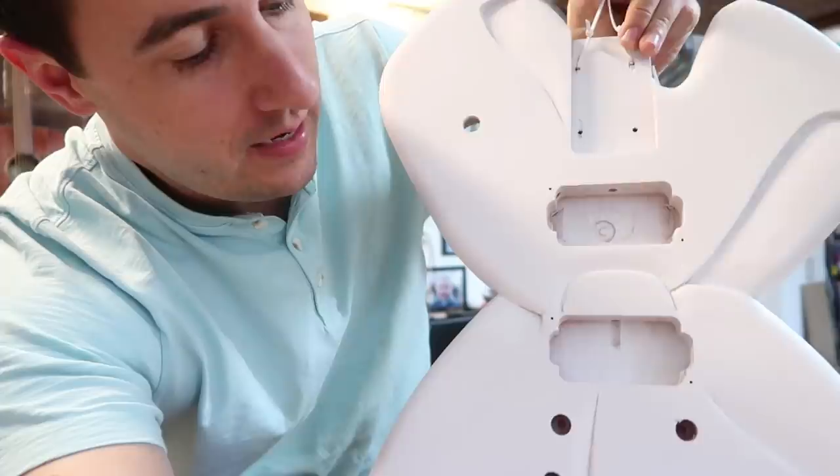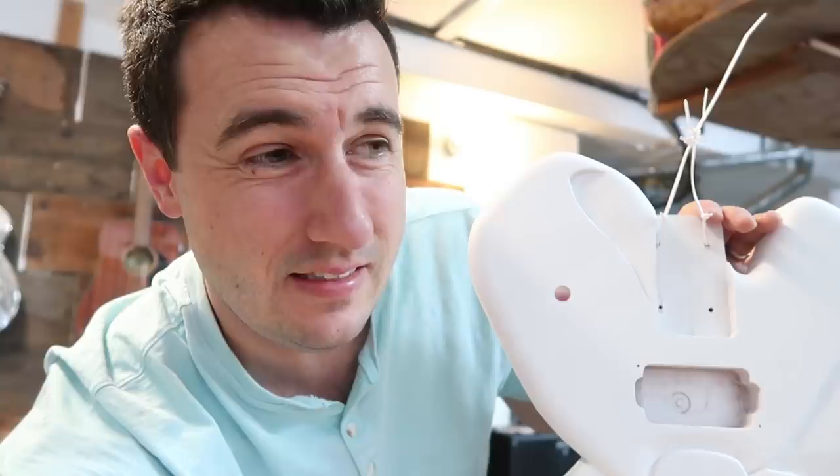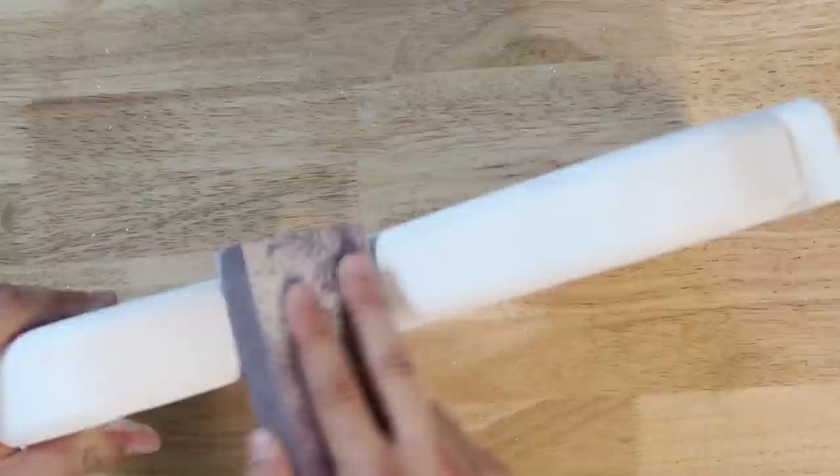So I finished that can of spray paint. I also hit it with a coat of gesso because that worked really well on Colleen's guitar. And this is what it looks like right now. It looks alright. I'm noticing a lot more flaws in it now that it's painted white. Without the grain hiding things, you see a lot more, and the grain actually raised a little bit on here. You can see a lot clearer now that it's white. So I'm going to sand it down again and take it from there.